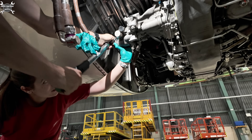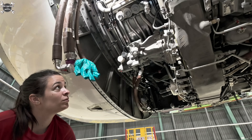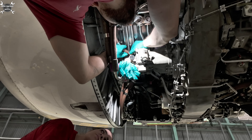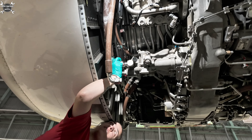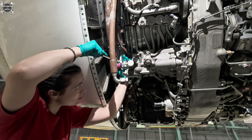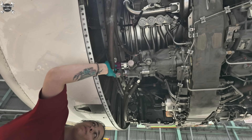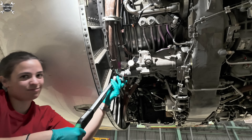When the pump is in place it's time for the unions - the hydraulic connections. We need to remove the plugs and place the hoses on the unions. This can sometimes be a real struggle because there can be a little tension on the hoses, slightly turned, and the nut just doesn't want to go on the union. Always remember it needs to go easy by hand at least from the beginning, because if it doesn't go by hand the nut is misaligned. If you use a wrench you can completely destroy the thread and then you have a bigger problem.